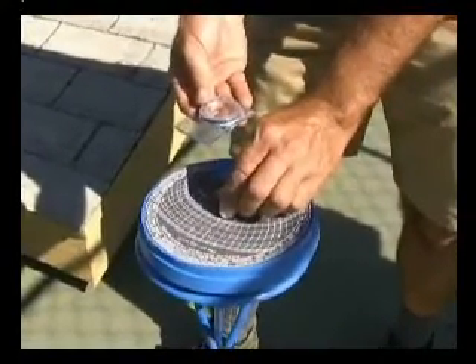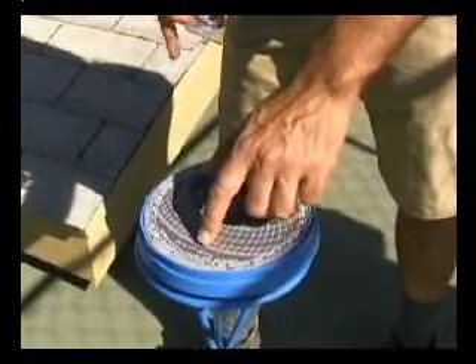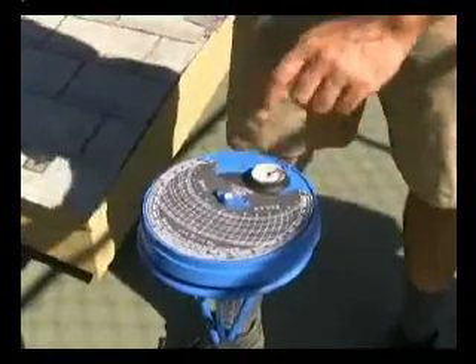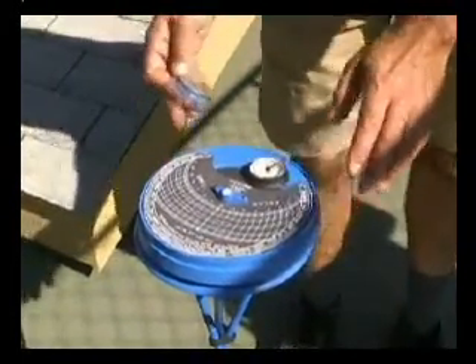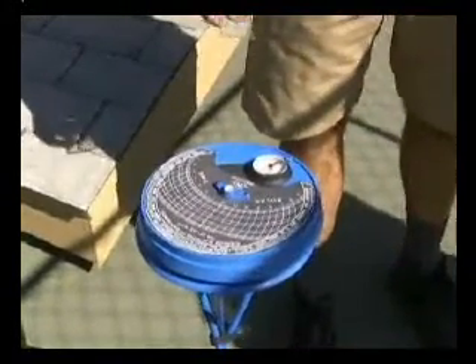This plate is specifically for latitude 37 degrees to 43 degrees north latitude, and they come with the Solar Pathfinder company. I want to make sure that we're leveled, and now we're corrected for what is due south for our location here.